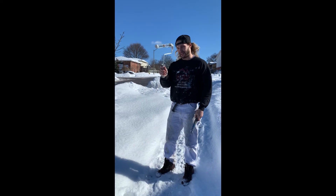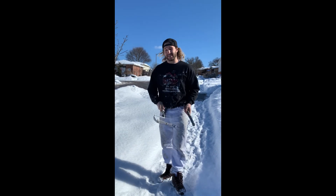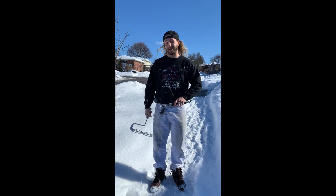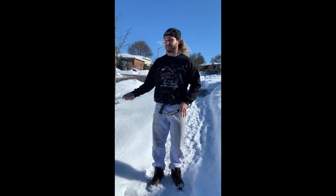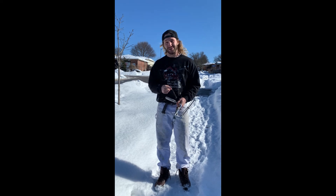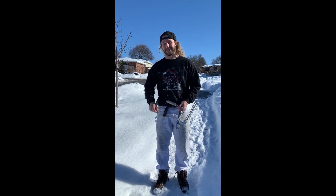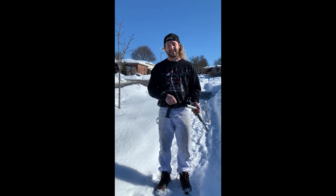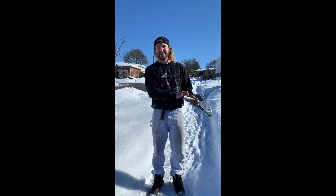Last thing is the head — just tip that out, not much water comes out of this. One other thing worth mentioning: you want to do the spinning outside, away from things you don't want to get paint on. At a client's house, find a spot on their lawn or an inconspicuous area. Because if you still have paint left in the roller or brush and it flies onto their car or patio that's a problem. If you're in a condo, do it into a garbage bag or right into the sink — you don't want to be over the railing spraying paint water onto glass.